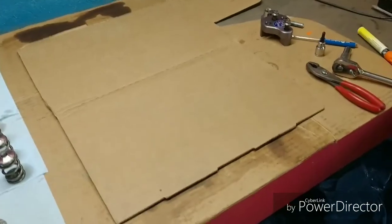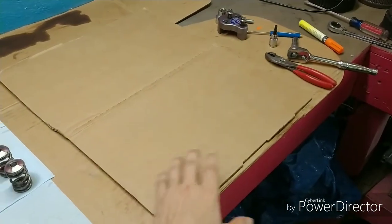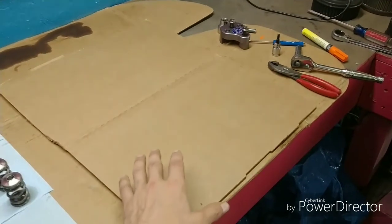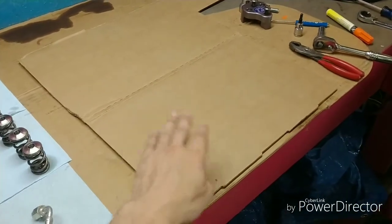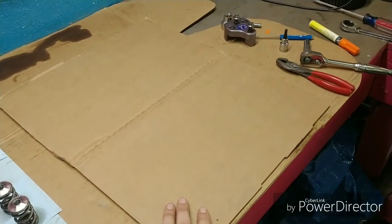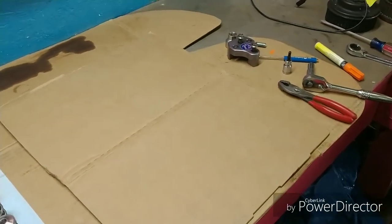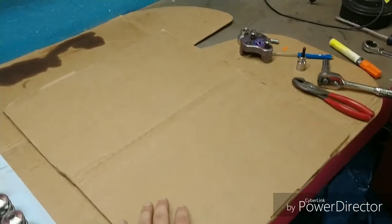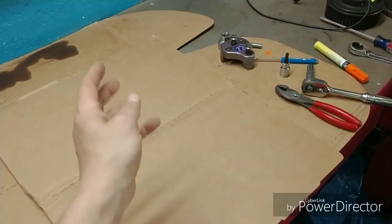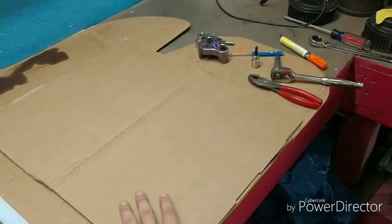I've got oil down, so I've laid down a nice clean sheet because we don't want any oil transferring to our nice clean head. The reason I laid down a clean sheet and not just paper towels is because the assembly oil will actually stick to the paper towel and then transfer over to the assembly. You really do not want pieces of paper towel in your motor assembly. So I'll be able to flip the head over, slide the valves in, lubricate everything, and get the assembly done.